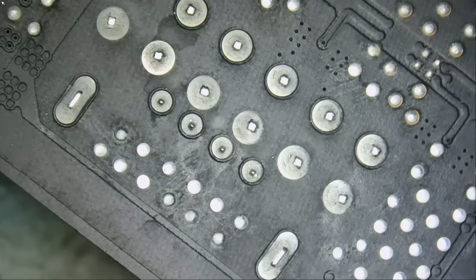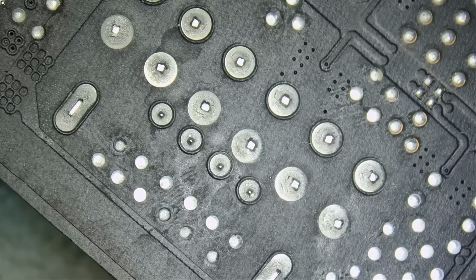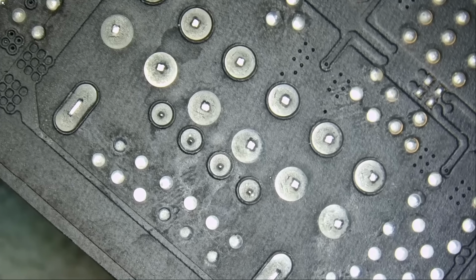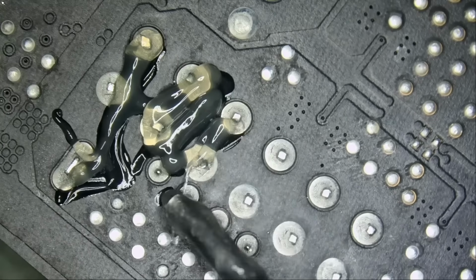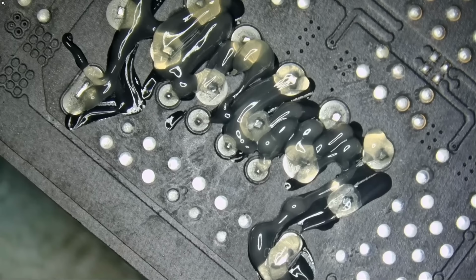You're gonna stress out the board. The board is what, 12 to 15 layers? The board has to absorb all the heat before it reaches the melting temperature of unleaded solder, and that's when joints will liquefy. So we do not just keep applying heat to remove that connector. What we do is we use low melt solder. I always talk about the magic of using low melt solder.